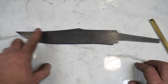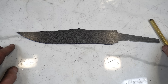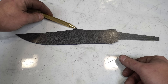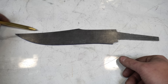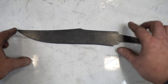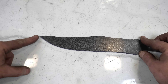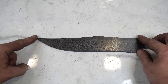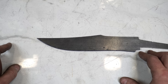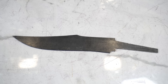Let's talk about false edges. We're going to do those first, and I'll explain why when we get to the grinder. So what is a false edge? That's going to be where we take this part here and bring it — not necessarily to sharp, but certainly to a point. There are a couple of different types of false edges. This one is curved, and you're going to do this one differently than one that's straight, which I tend to call a harpoon edge. When we get to the grinder I'll explain the different tooling you're going to need for those.